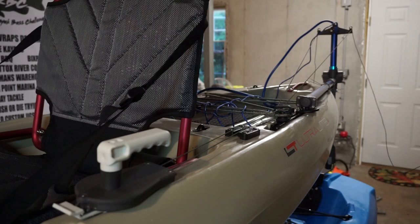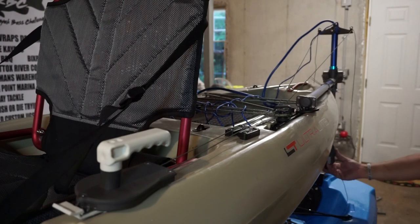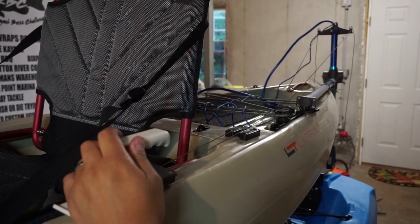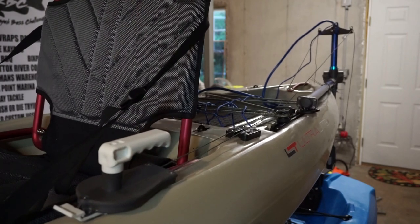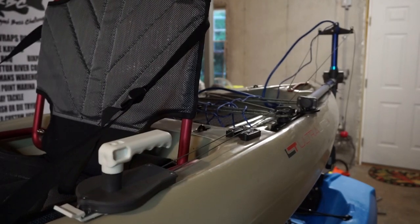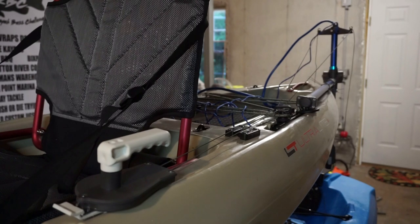I will clean up a lot of this cable — just go ahead and cut it off and tie it off a little better, clip these zip ties. I'm going to move these collars down a little bit to move the motor up some. But other than that, this thing is ready to go and I'm actually really excited about this because it is so universal. The only thing we had to drill was the mount for this handle here, and really, if you didn't want to do that, some industrial strength or outdoor weather-rated Velcro would work perfectly fine. I can't wait to get this on the water — especially since it's so responsive and this is such a light, fast boat.